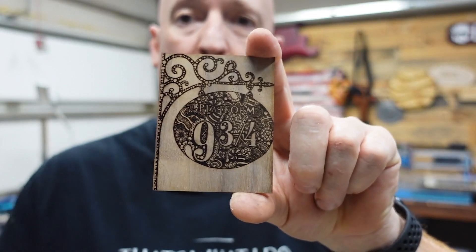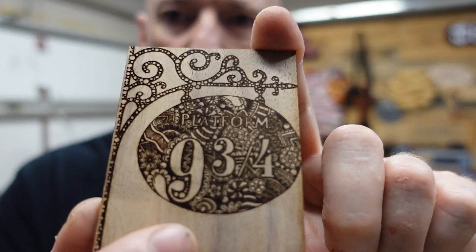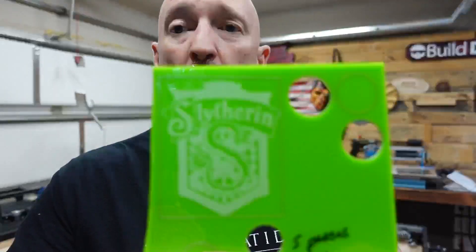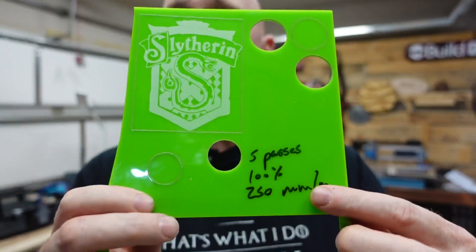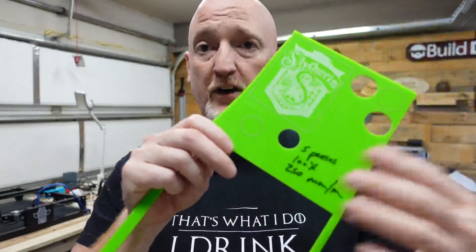This is three millimeter walnut — we got that dark engrave, though I think I went a little heavy. If you look at it real close, the details are a little muddled by the heat of the laser, but it did cut through it as well. It will definitely engrave on acrylic. It did have a little bit of a rough time cutting — I did two passes and it didn't cut all the way through. What I wound up finding out is that five passes at 100% power, 250 millimeters per minute, will cut through. So if you want to work with acrylic, you can definitely do it with this laser.